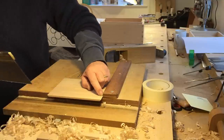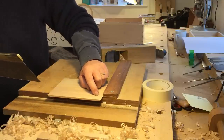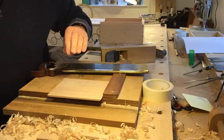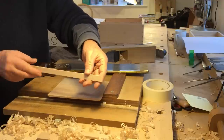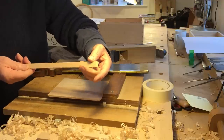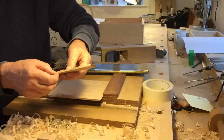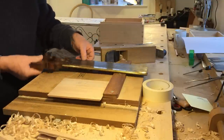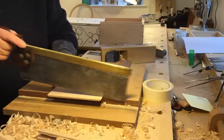I'm going to start just about a millimeter or so away from my line. I don't go for the line — I want to saw a millimeter away, because a saw will leave something called a rag on the component. So you want to just be away from the line by a little bit. Then sawing gives you a millimeter room to play with.